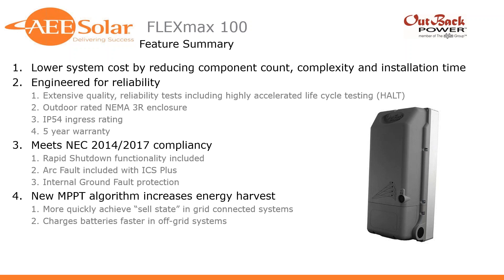HALT testing is pretty interesting. If you've ever seen one of these test chambers, it's a unique machine. Essentially, what they're trying to do is accelerate the life cycle of a product and estimate its performance at the end of its life cycle. Rather than powering it up and waiting 10 years, they accelerate it by putting it in a chamber that heats it up, cools it off, heats it up, cools it off — under power — simulating what performance will look like at the end of life after running through three to five thousand cycles of daily use.